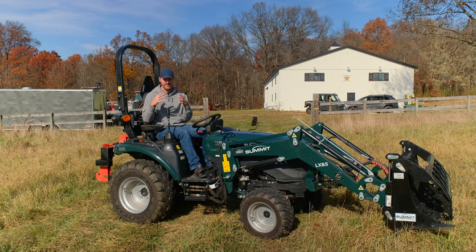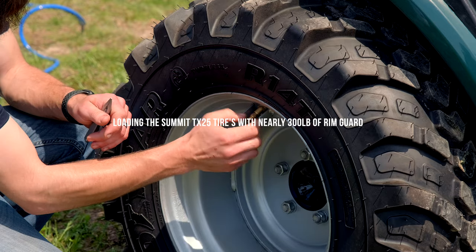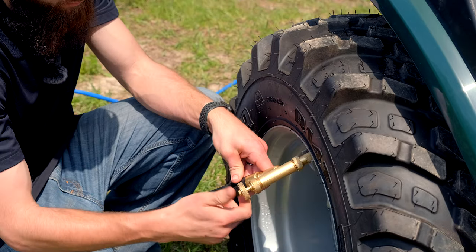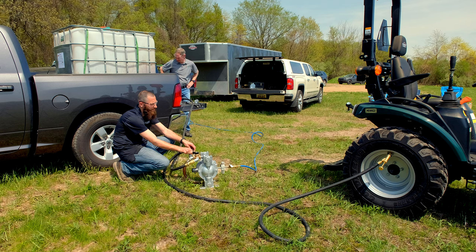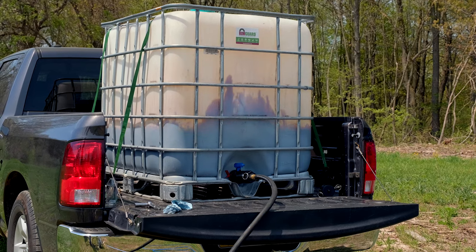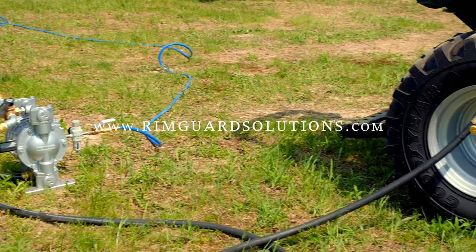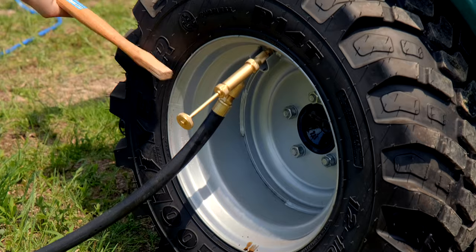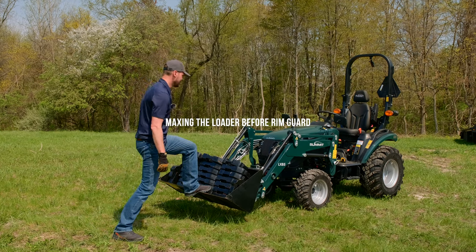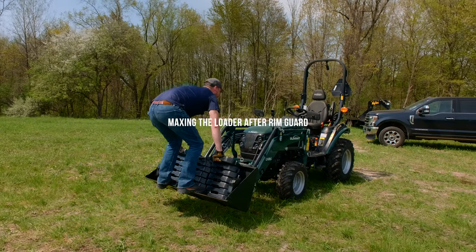First, we're going to talk about liquid ballast in general. I like it a lot because it's just hidden out of the way. A lot of these ballast weight options tie up your three-point hitch, and then you have to make a tough decision: do I want as much weight as I can put on there, or do I want a useful tool? Liquid ballast, like Rimguard — our channel sponsor — fits right inside the tires. This tractor has over 300 pounds of weight just hiding in these tires, out of the way, keeping you planted to the ground. Folks down south who can get away with water or washer fluid, those are good options too, but you don't want something that corrodes. Rimguard is not corrosive, doesn't freeze, it's all natural, and it's going to be the heaviest all-natural weight on the market on a per-gallon basis.